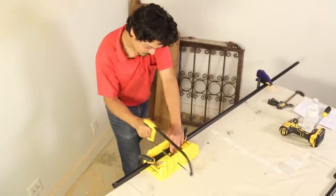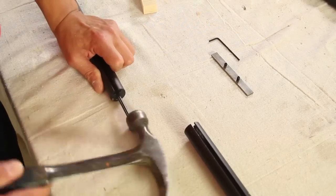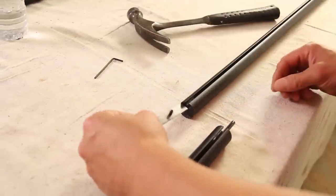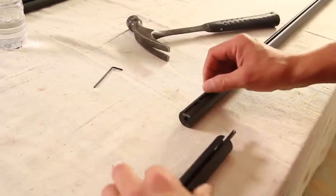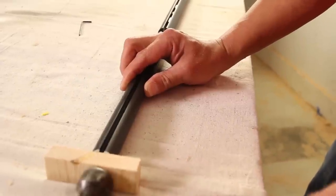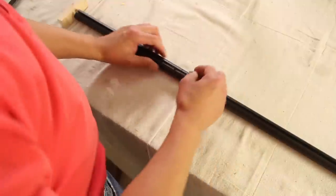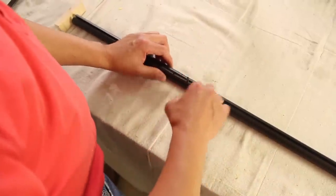With your track, you can cut it down if necessary by using a miter box and hacksaw. To join two pieces together, tap a threaded rod into the hole at one end of the track with a hammer and slide a splicing block into the groove. Use the hammer and a caul to tap the pieces of track together, then center the splicing block where the sections meet, turning the set screws to lock it in place.